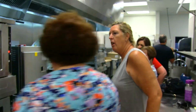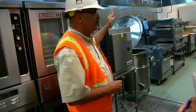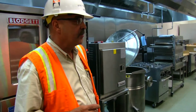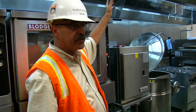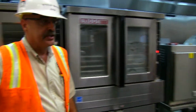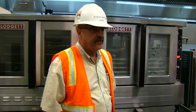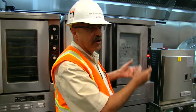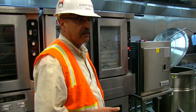Yeah. One question here. Where do we turn our fan on in the morning? We turn the hood. Okay, let me handle it. Okay, so the Gaylord hood has four temperature sensors. The system's set up on an auto start. When the sensors here are 10 to 12 degrees above a little temperature sensor in the control panel, the fan will turn on. It's a variable speed fan, so as the temperature gets hotter, you pull more air out. As it cools down, the fan speed slows down.